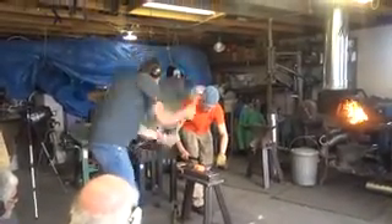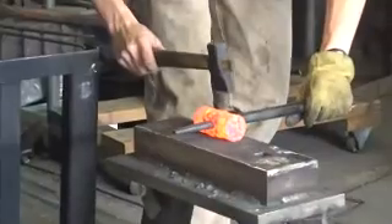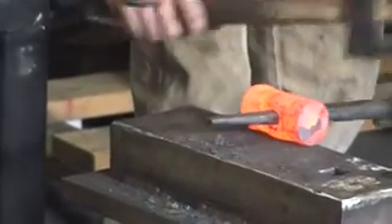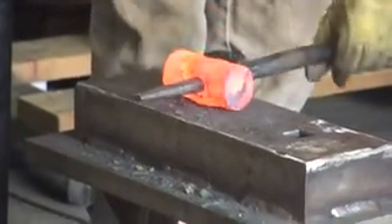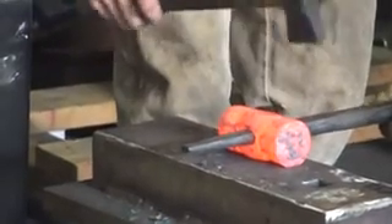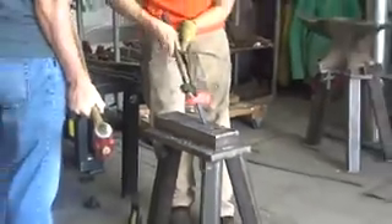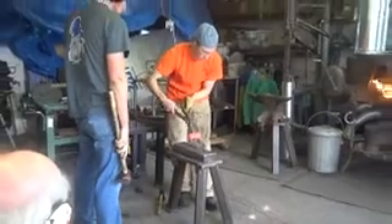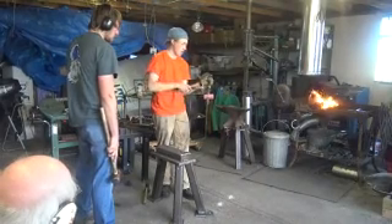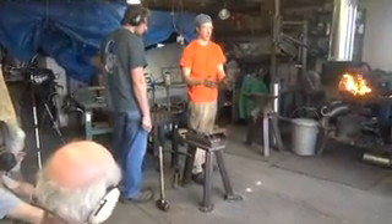And the side of the eye — I'd be closing the hammer onto the drift. Now I've worked until that swell from drifting has been worked up into the cheeks and is now level and flat with the sides of the face of the hammer. So I'm going to stop here and do the other side in order to fit the curve of the cheeks that supports the hammer from beneath.